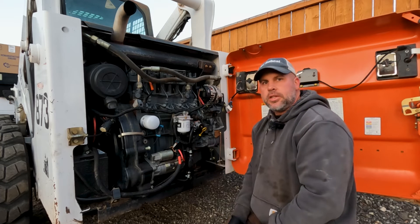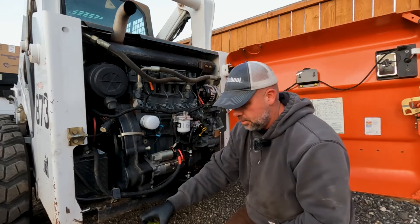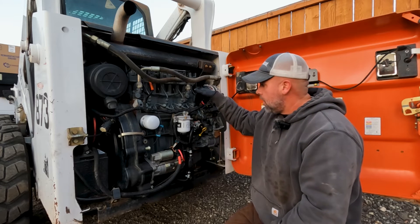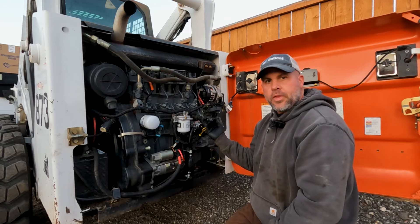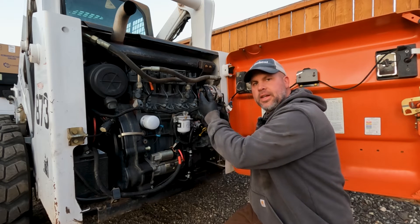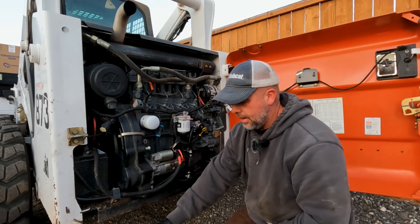And while yes, I've seen algae in these fuel tanks before, more commonly on the Deutz what we're looking at is engine oil in the fuel tank. What happens is on our primer pump here, there's a diaphragm inside, and on the other side of that diaphragm is just a little lever that runs on a cam lobe. So engine oil is on that side of the pump. When that diaphragm starts to go bad, it pulls oil into the pump and starts recirculating a small amount of engine oil through the system back into the tank. So it doesn't take a lot of engine oil for your fuel to look black like that.